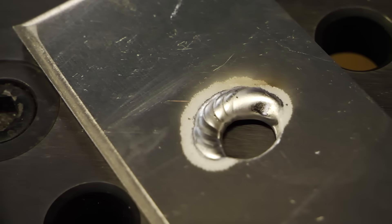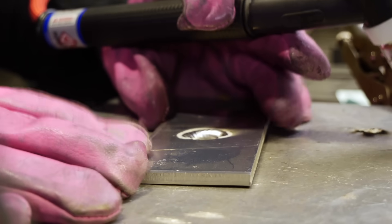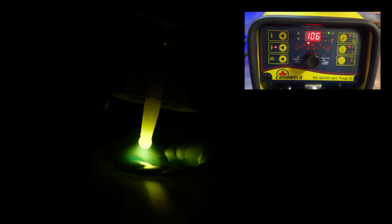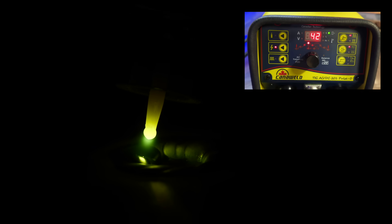What we're going to want to do is stick to the edge and focus your filler material there as well. As you weld around towards yourself at the halfway point, I would want to see somebody extinguish just as they're starting to get uncomfortable. Then you're going to flip the piece around or stand on the other side of the project, and repeat on the other side. At this point, we do not want to overfill with filler material and we especially do not want to overheat it.